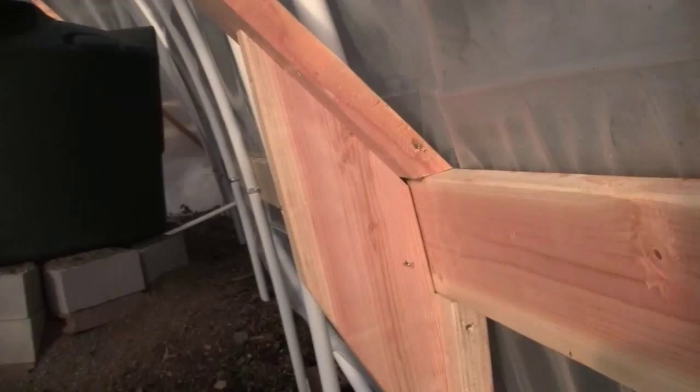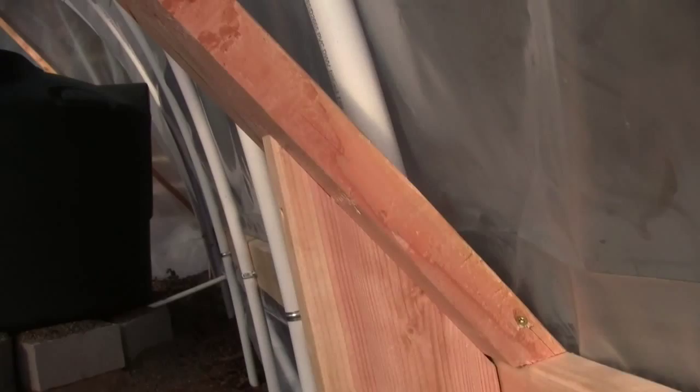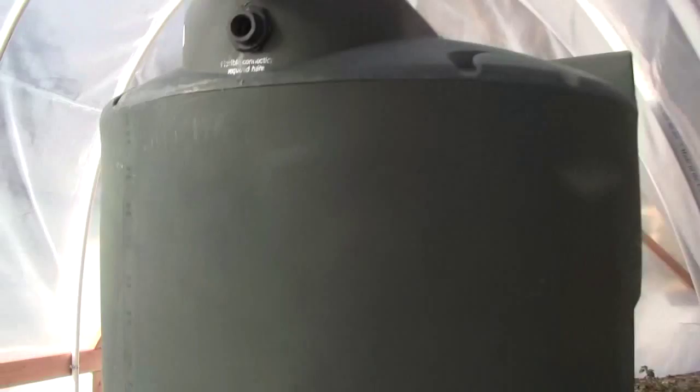I repeated that same process in the middle and again on the end. In the middle I added a board just to tie the three boards together, but I didn't run the casing all the way around. Instead I added a little bit of a horizontal truss there. Now when I try to shake the whole greenhouse, pulling really hard, it hardly moves at all. Very secure. Wish we'd done this over at the other place.